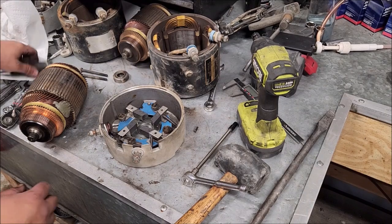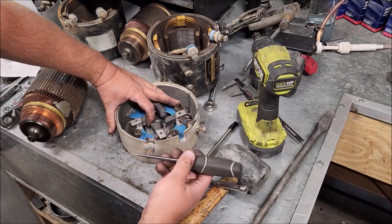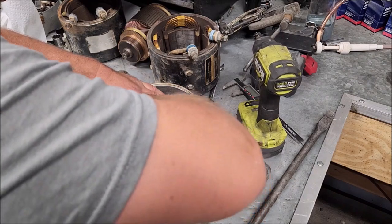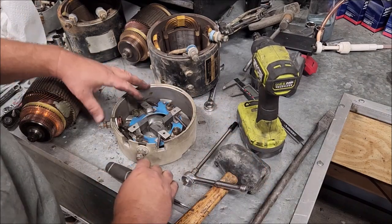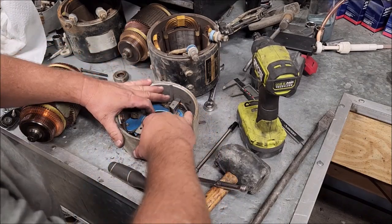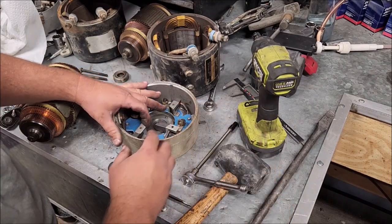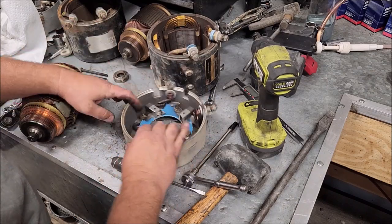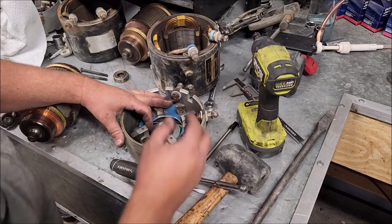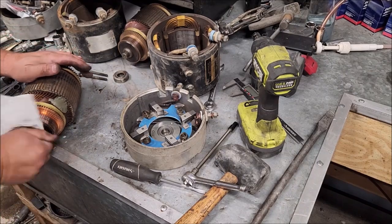Alright, fun part - brushes. You can't put this thing in there because the brushes don't let you. So what you can do is push the spring down and out of the way so the brushes don't do anything, and then go in there with a little pick afterwards and get that spring back on the brushes. All I'm doing is putting the spring clip right below the brushes - it puts some weight on them upwards and holds them in their spot, just like so. Now the brushes don't come into play. Clean off the shaft and lower this into the bearing.